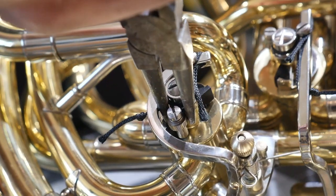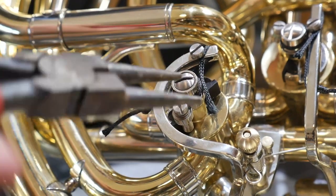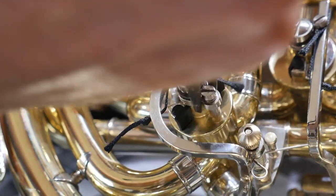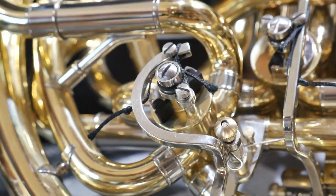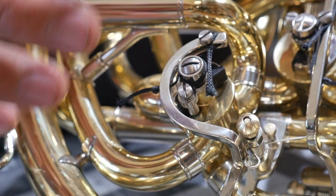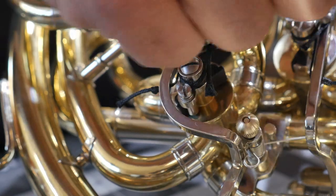Come in with the round nose pliers and grab a hold of that entire armature right there. Notice how I'm well above the plate itself, so I'm not afraid of the tips hitting down on the plate, but I've got a solid grip on it. Then I'm just going to turn it from there — work it back and forth once or twice with the pliers — and now I've got some movement out of that. Obviously the entire rotor is really dry and we need to get it re-lubricated, but we'll do that at the same time we do all the rest.